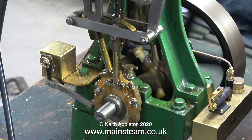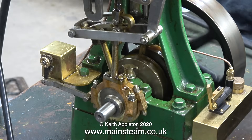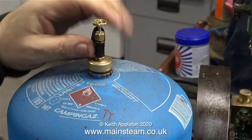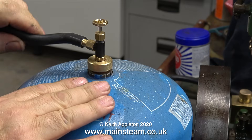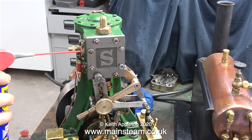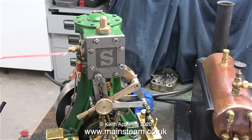The temperature of the steam supplied by a boiler is relative to the pressure inside the boiler. Water in a domestic kettle boils at 100 degrees centigrade, and that's at atmospheric pressure. The higher the pressure in the boiler, the hotter the steam gets. I mentioned this in a video a couple of years ago, but all I got was someone who wrote in to tell me this was not the case. But take it from me: as the pressure rises, the temperature rises.